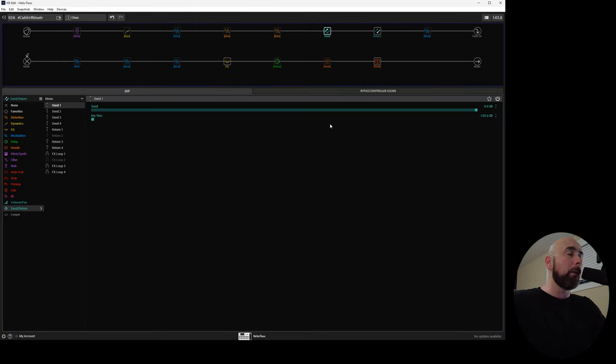Now it's very important on this send block that I go to my global settings on my Helix and set this as an instrument output, not line level, because this send is going to be feeding, and I notice I have it on send one, so I would plug send one out of the Helix into the input, the guitar input of the Tonex pedal. The guitar input of the Tonex pedal is expecting to see an instrument level signal because that's where we would normally plug our guitar into it. So we would want to go to global settings and set send one to instrument level.